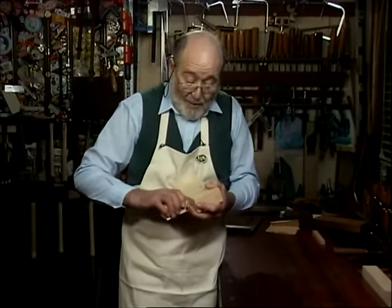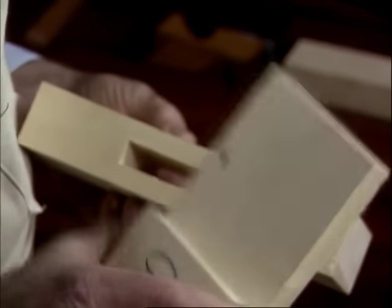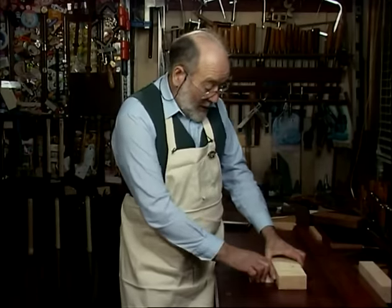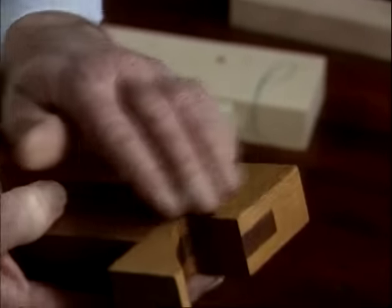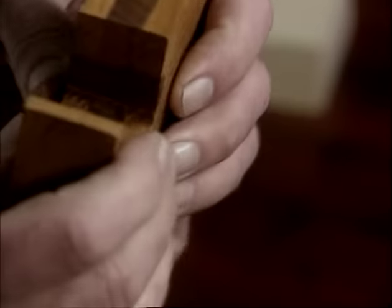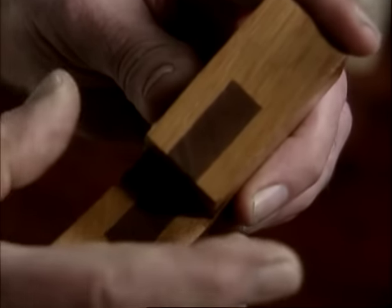If we're going to talk about mortises and tenons, let's have a look at one. There we've got the mortise — a through mortise, right through the job. And there's the tenon. It used to be called the tenant because it lived in the mortise. Now it's nice and tight, a nice fit right through. This is a straightforward through mortise and tenon. You can see that the tenon fits the mortise all the way through the job — we haven't cheated by making a belly-shaped mortise. It fits all the way through, not just at the start and the finish. How do we manage that? We work super accurately.